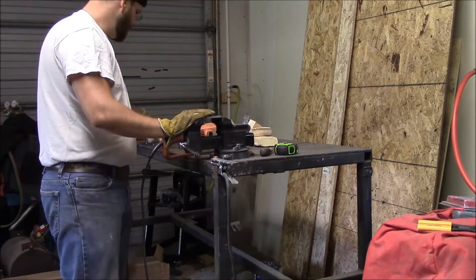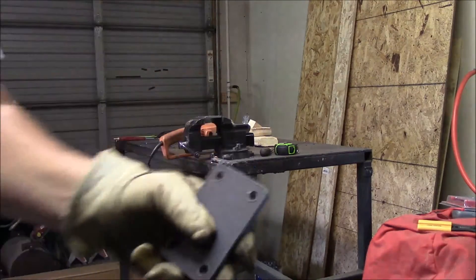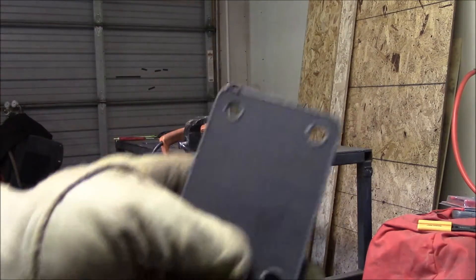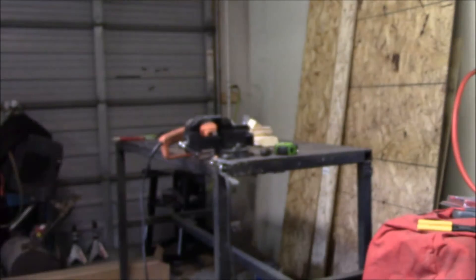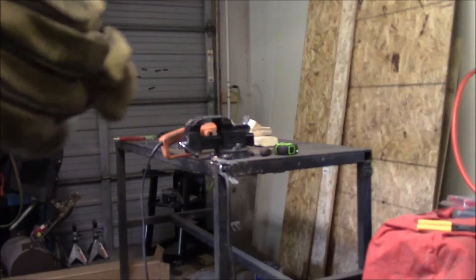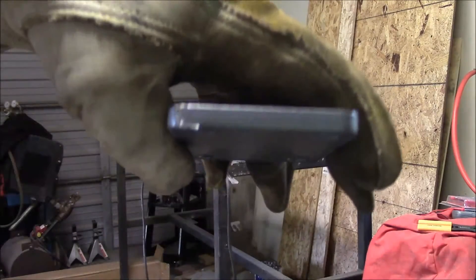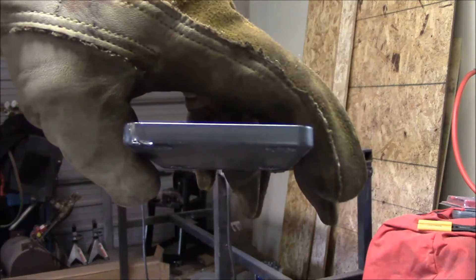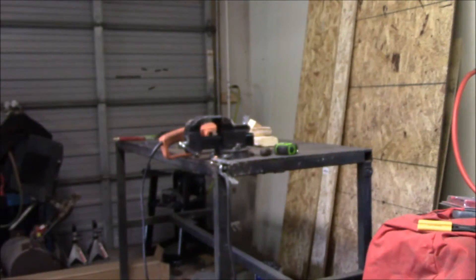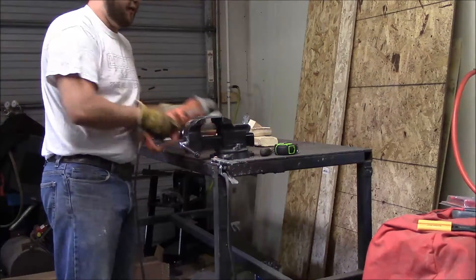What I've got here is just from the plasma cut — we've got this left-behind dross. Judging from the lines, what you're seeing is that the cutting speed was a little slow for the operation.